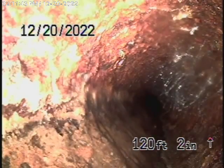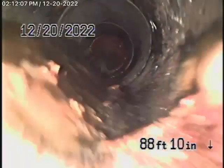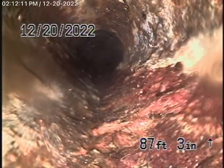We've made locations along the way. Further down, you can see how old the pipe is going down here. Right over here, that's where the little house at the bottom ties in — all with ABS plastic. So you can see ABS plastic underneath that was tied into the main line. You can see how old this cast iron pipe is — it's very old. Definitely recommend it to be replaced.